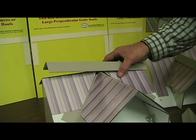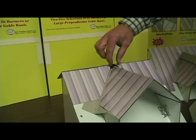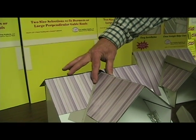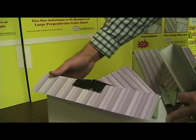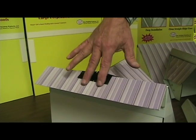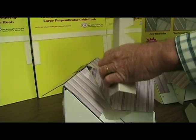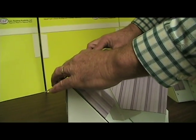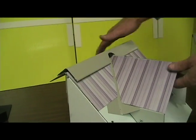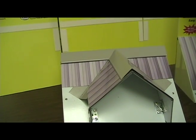Been asked many times, how can I repair that? Well, the way to correctly do that is use a valley cap. On the front side where you have your 2 valleys, you get your 100% watershed leak-free joint. And then on the back, we fold the valley cap over the top of the panels. So any rain that might hit there would run right off onto the panel and off onto the ground or in the gutter system. The beauty part of this is they can notch the ridge cap. They notch it, it's still a 100% leak-free joint. The ridge line is perfectly straight and beautiful. And then this ridge cap just simply goes on and covers the valley cap.